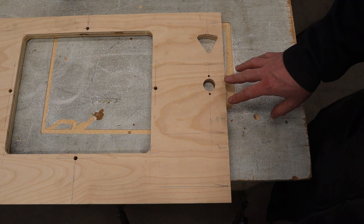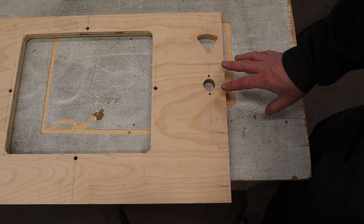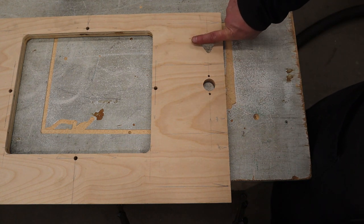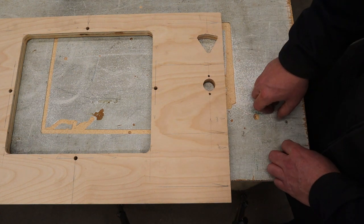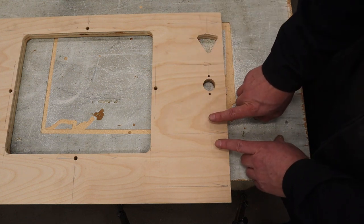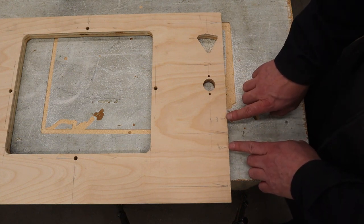Quick note before we start drilling here. When you start laying out where you want your pocket holes on your actual parts, there are some other things you gotta worry about. You do not want to be starting to put pocket holes right over through your plungers or through your buttons or where your leg bolts go. So, on your parts, figure out where stuff goes. If you don't know the dimensions for like where your leg bolts go, take a look on ngrnet.org and lay those out so that you don't put them there.